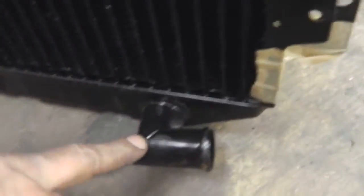Guys, there's no way I'm going to be able to do it. That's going to need a new front piece soldering in there. I just can't get this to braze up. It's just too thin. I'm just wasting my time. It's blowing through and there's pinholes in it. I can see them through the light.